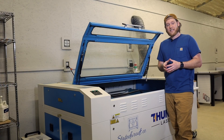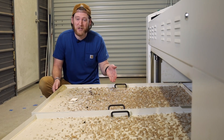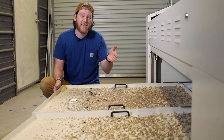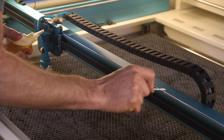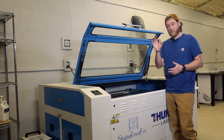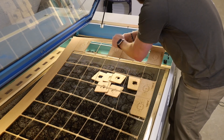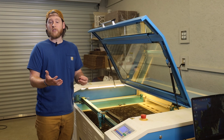We are doing a whole video on maintenance and cleaning of your laser, so check that out on our channel. The inside of the debris tray is slammed with millions of little parts and pieces coming off the bed — this is after 184 hours of cutting, probably 60,000 different parts. It's really cool to see, but I would clean this way more often than I did. It could be a fire hazard if you're cutting things like wood or paper. The biggest and most important thing to regularly maintain are your mirrors. Keeping them clean and aligned is very important. If your mirrors start to get dirty or damaged, the power of the laser starts to reduce and cause cutting power to drop — you may find that parts are not falling out or cut all the way through. That's a clear sign your mirrors are dirty, so regular cleaning is very important.